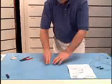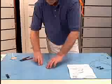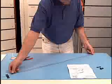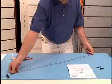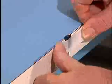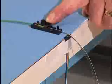The fiber length may be shortened to suit your specific installation requirements. However, you will also have to cut the breakout terminal assembly tubes to this length. Align the tube end with the front tab of the base and crimp the tabs. To aid fiber insertion, straighten the terminal assembly tubes and tape the unit onto the side of the work area.